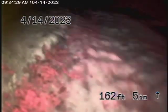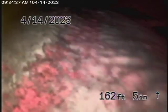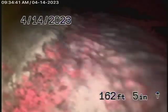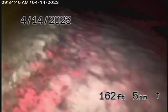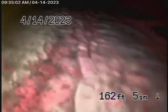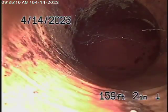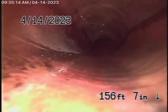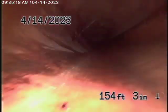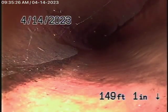There was one spot in the line going downhill where we had a very tough time trying to get our camera over. The grade going downhill to the street is very good. What we're looking at right here is the city sewer — it's flying by right there. It looks like we have a six-inch cured-in-place pipe lining from the middle of the street back toward the property, and it appears to be in good condition as of today.